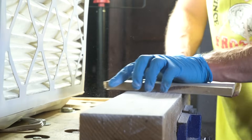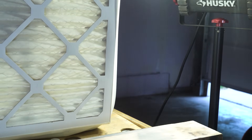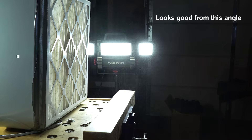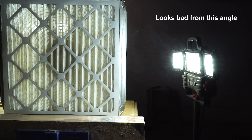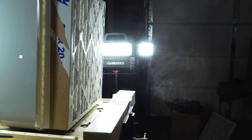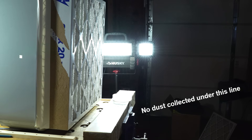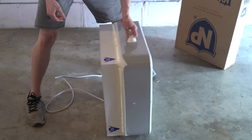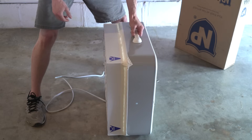Then I ran a few more tests with the single filter options as they are the most affordable, and I wanted to know exactly what you could expect from them. The dust in the air does not always make it through the YouTube compression process, but hopefully you can see what's happening here. In order for the 1-inch filter to capture the airborne dust, I need to be directly in front of the fan — if I throw some dust into the air, most of it ends up getting blown past the fan into the room, which seems like a great way to spread more dust rather than control it. The 4-inch filter performs a lot better and managed to pull the majority of the dust into the filter, though I still need to be within a foot or two of the filter for the best effect. One thing I like about the larger Air King fan is that it's heavier and can actually stand on its own, unlike the Lasco fan which wants to tip over, especially with the 4-inch filter.